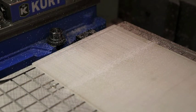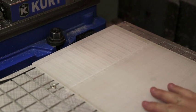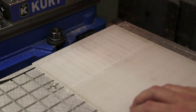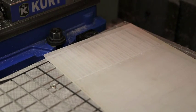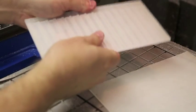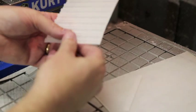The machine just finished cutting all the parts and I'm going to blow it off with air. I wasn't able to fit in my 20 units because the plastic was a little bit shorter, but I was able to do 15 and I'll do another 15 here. Now I'm going to show you how I can take advantage of the plastic being so brittle. Before, when I would machine this, the brittleness was working against me — now it's going to work for me because I'm going to be able to break out all these parts. See, there's an almost finished part.